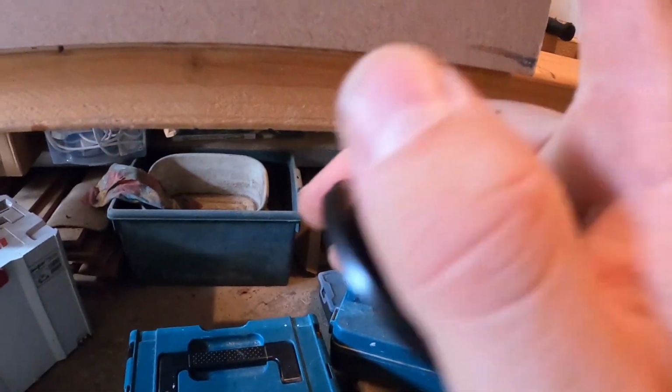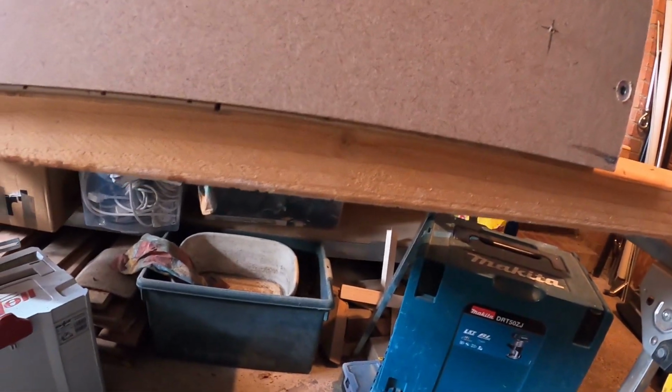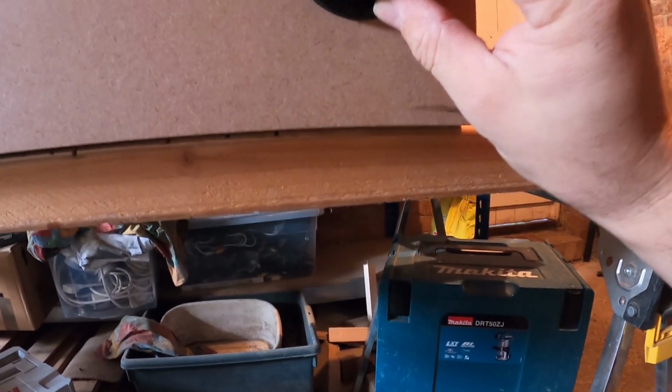So when I set up the legs, I put 60 off the edge, 60 down, that's on the back, and then I do 60 on the side, 55 on the front, to get that plinth slightly back from the front legs of the front of the unit. And I always fit it like so. My first screw is the center screw of the leg, and then the back goes in, and I do the same way, with this bit facing in into the unit.